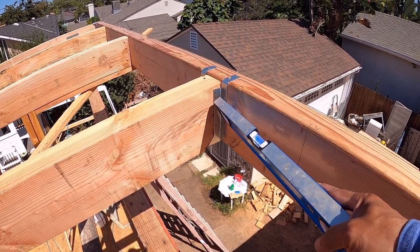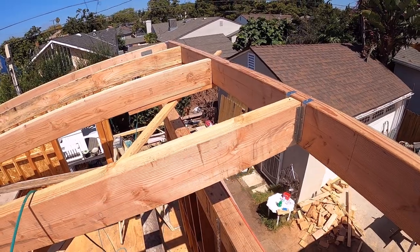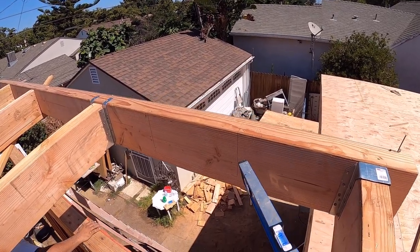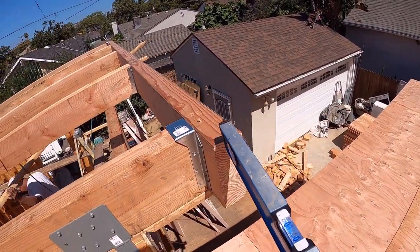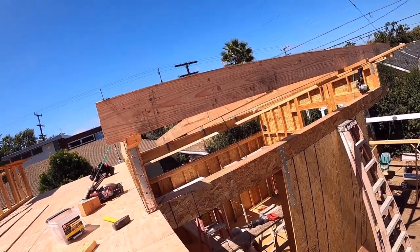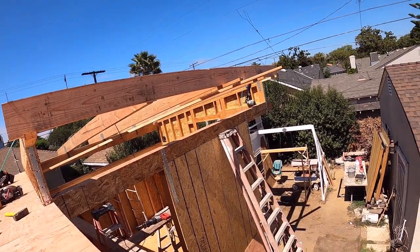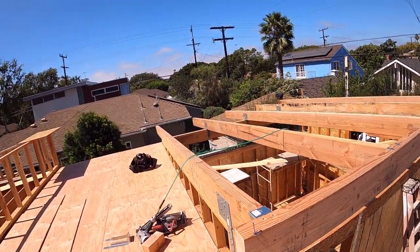It hangs and wraps around on top of this beam so it will carry the beam here. Those beams in the middle are every four feet on center, and in between there will be two by ten lumber, two lines. This beam carries that middle part above the Clerestory — below is the Clerestory window, and it's hanging.